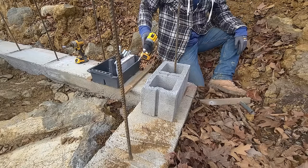Here's what we're gonna do. We're gonna take some random pieces of lumber. I had to get out of here yesterday, it snowed. Let's get some lumber, and we're gonna attach some 3/4 inch EMT to it, maybe 8 inches or so. I'm gonna attach them right about here with a couple screws. Can you see that? Right about there. My goal here is just to give myself something that I could attach a piece of maker pipe to.